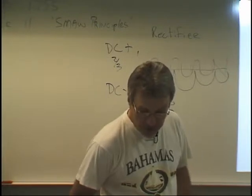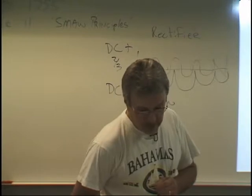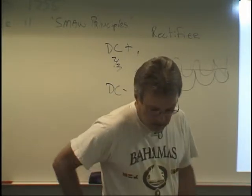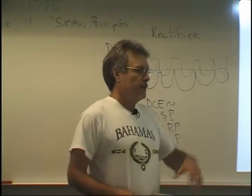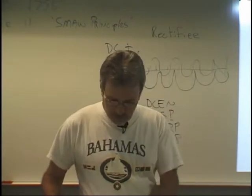If voltage is too high, the arc is too harsh and may produce arc blow. On the other hand, if it is too low, it is very difficult to maintain the arc. Also, if you turn the voltage up too high, you get an unstable arc and it can cause porosity. So you want to keep that in mind too.